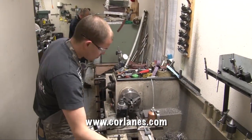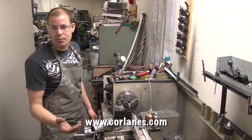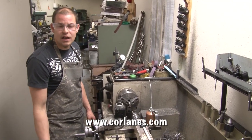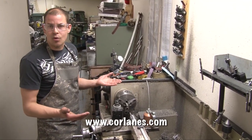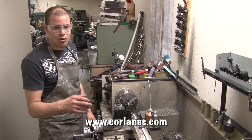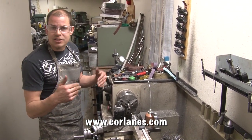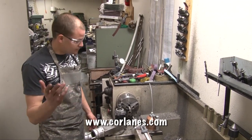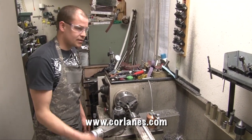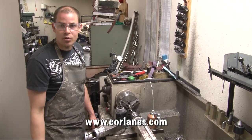So now in the little lathe, we're going to run the pilot hole size. We've got a .308 caliber — a .30 cal — and I've got a drill that's .030 overbore size. You'll see people go from .020 to .030 overbore, and that works good. You don't want the hole too big or it becomes less effective; too small, you have the risk of corrosion and debris on the leading edges maybe interfering with the bullet's travel. The factory standard is 20 to 30 thousandths overbore. So we've got a .308, and this cutter is roughly .338 to .340 when we bore this hole.